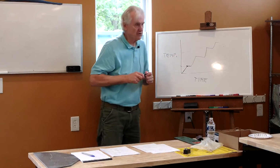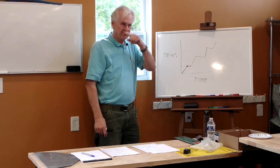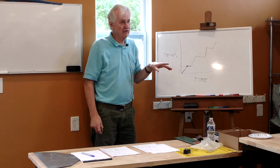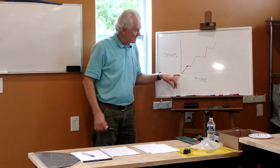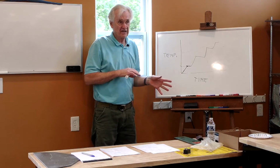And you might be able to say, well, I'm doing a really weird firing and I don't want to fly right past a certain temperature. I want to go up to a certain temperature. I want to stay there for a while. And these canned programs won't do that. They're pretty much set to be kind of routine bisque firings or routine glaze firings. So this gives you the opportunity to write your own custom programs for sort of unusual applications.